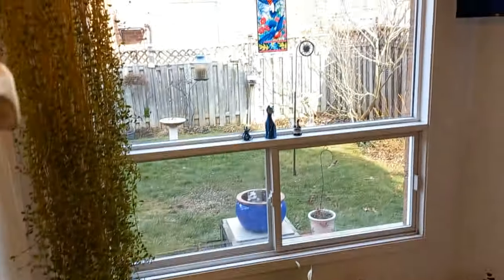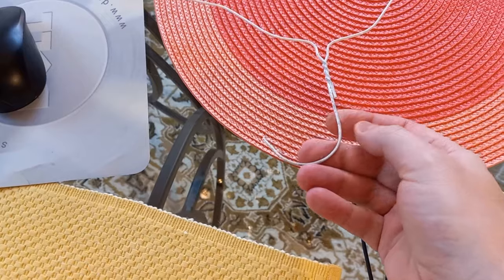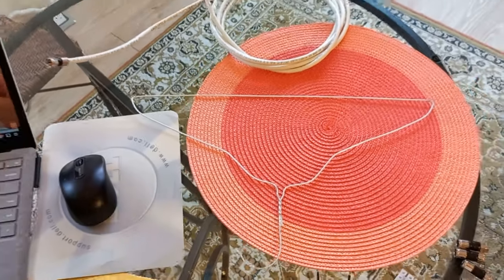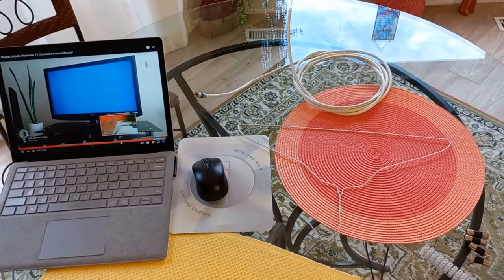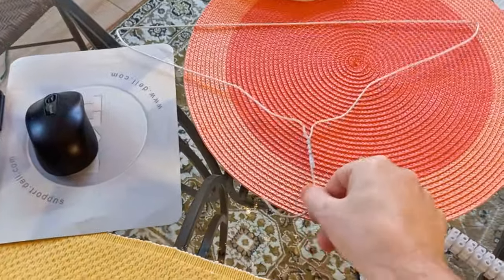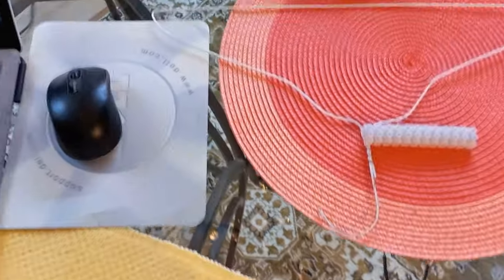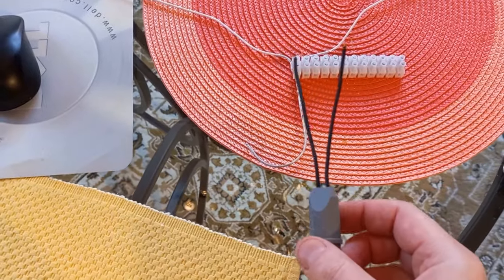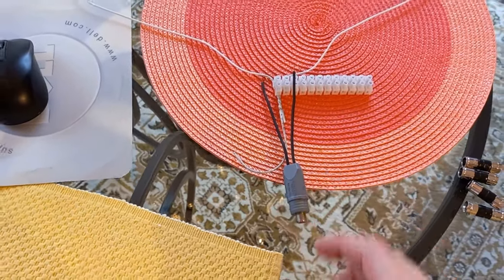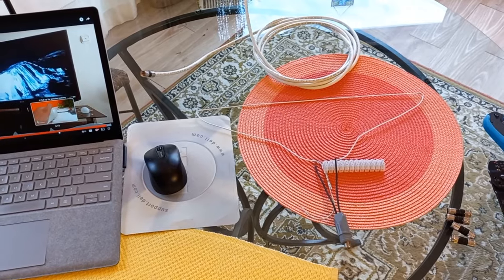In the center there's a wire that carries the signal. So what we're first going to do is take this coat hanger, tape it onto the window, and connect that center wire to make it an antenna element. We will then do a scan with the TV and see what we can actually pick up. Then we're going to make it into an impedance matched antenna using a terminal strip and a balun transformer - 300 ohm to 75 ohm, which is the same as the coax. That's the more proper way of doing it and we will see if there is an improvement. Then we'll try to put an amplifier on it as well and see if we can make it an active antenna.